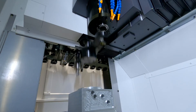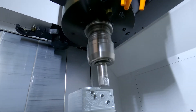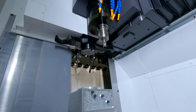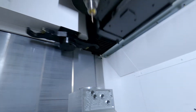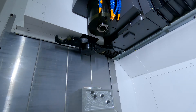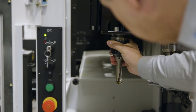The core is the integrated motor spindle with cooling through the spindle. Choose one of the different versions from 6,000 to 35,000 RPM. The tool change takes place on the left-hand side and is incredibly fast at 1.2 seconds. Our front loading station is used for simple and uncomplicated loading.